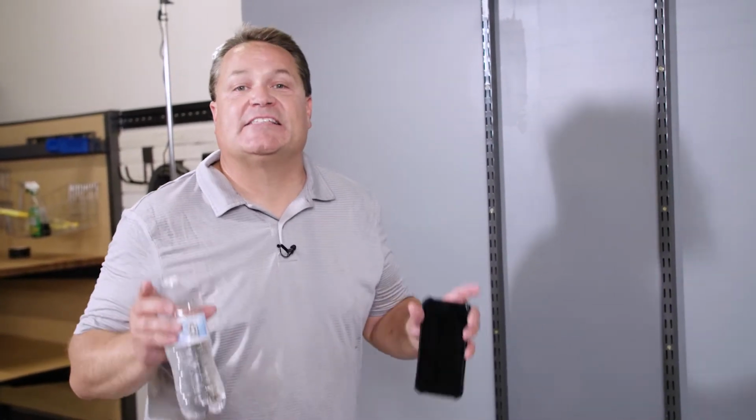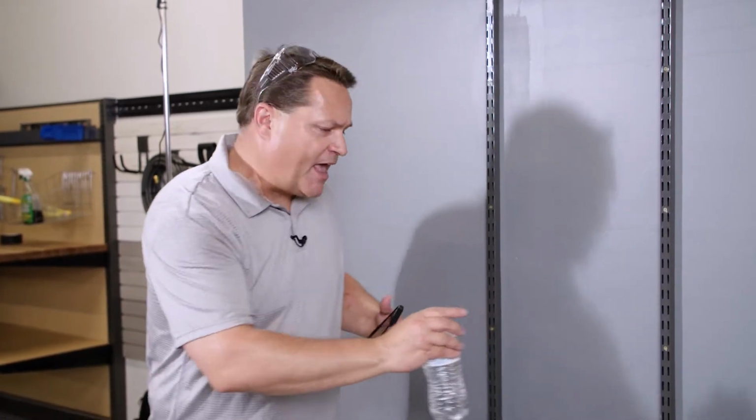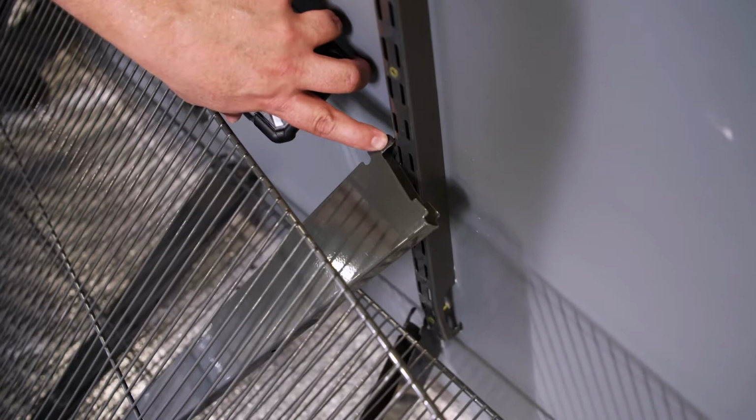Oh, that's better. Oh, hey, after a recount, that was the 16th case, so that would be exactly 400 pounds. Now, I checked the website, and actually the manufacturer says that that shelf should be able to hold 400 pounds. Now, engineers like to use something called a factor of safety, which means we shouldn't actually be told that we can load it right up to the failure point. Look what happened here. This is the tooth of the bracket. It actually sheared clean off at exactly 400 pounds. 400 pounds is not bad, but I think there's some shelves that can do a lot better than that.